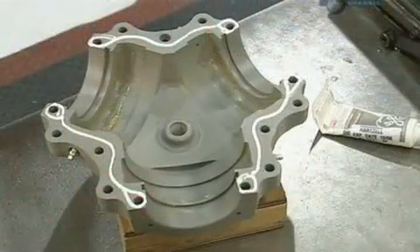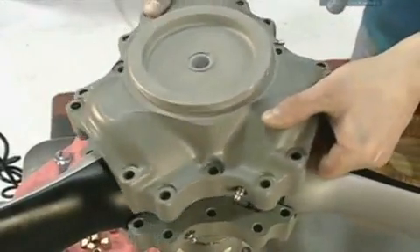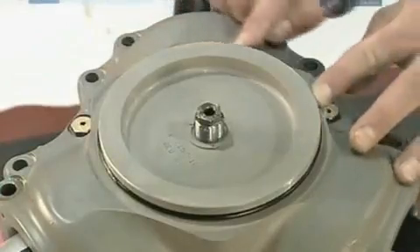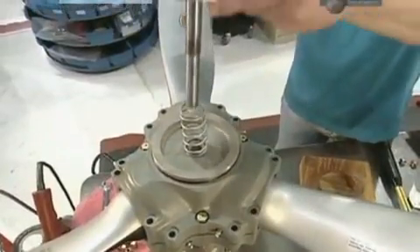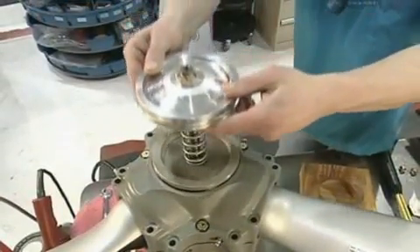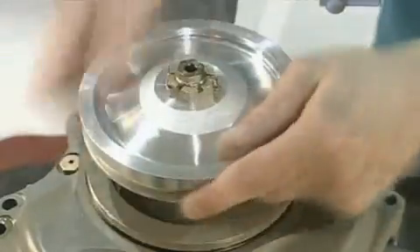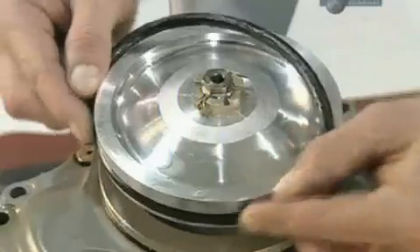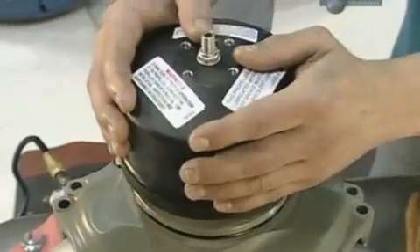The pitch change rod is temporarily removed and sealant is applied to the top half of the hub. It's then placed over the bottom half that contains the ball bearing set. A rubber seal is added, then a sturdy spring to provide the required counter pressure. The piston and pitch change rod, which are now attached to each other, are threaded onto the fork. Another seal is added — this one prevents leaks from the top of the cylinder that will contain the engine oil.